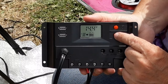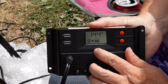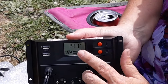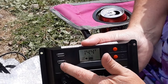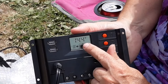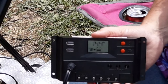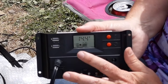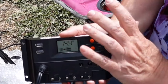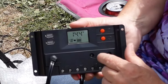When you press it to go to your second screen, this is what we call a boost. This actually is not just a display change — it's changing what's happening. You've got no light bulb picture, so you're not sending anything to your load plug-ins. All of the juice is going to go into that battery, and it wants to get up to 14.4 volts. That's preset as your maximum charge on your battery, and there are ways to change that. So this is sending all of my juice as hard and fast as it can to this battery, which I like because I want my battery to be fully charged.